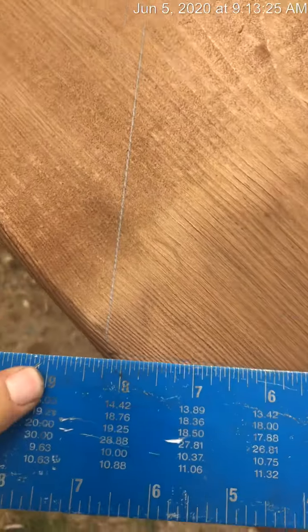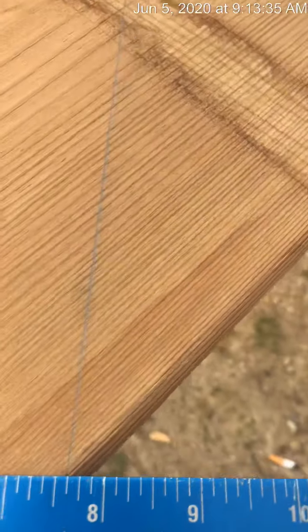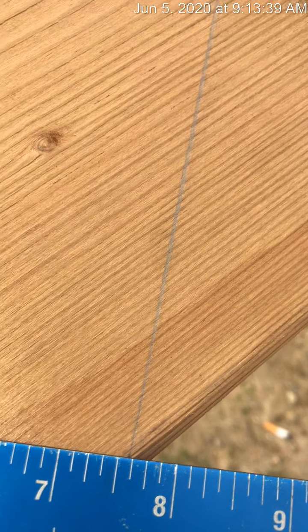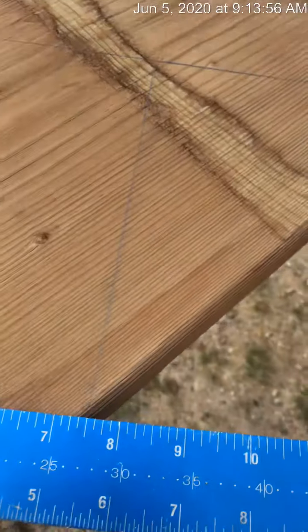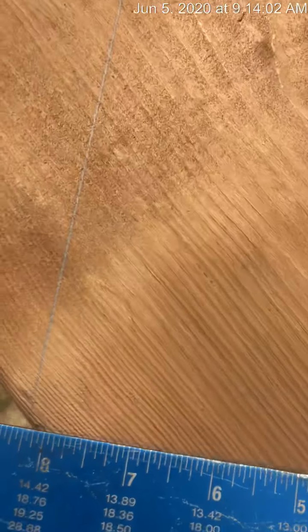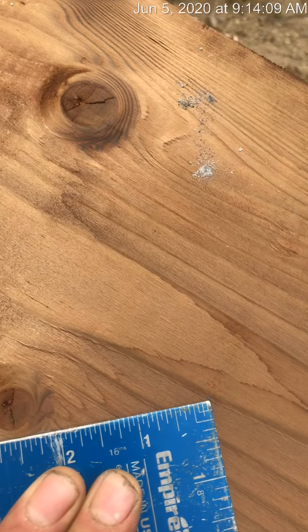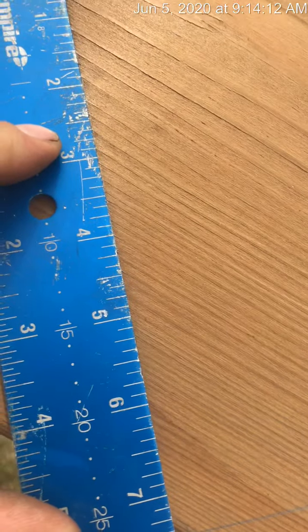If you look here, I've got eight and a quarter right there to the edge of my wood. We're going to hold that with one hand and come over here — my seven and a half wasn't quite right so I adjusted it. Now you can see that I've got my seven and a half right to the edge of the wood and my eight and a quarter is right to the edge of the wood. This line here is my tread and this side of the square would be my rise.